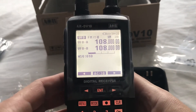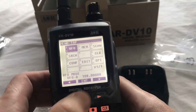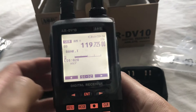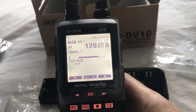Right, let's have a quick go of this then. Let me just get the backlight on - I've just programmed search bank zero for airband. So let's do search, execute. This is just with the AOR antenna on it, just seeing a quick 25 kilohertz step search around the airband.